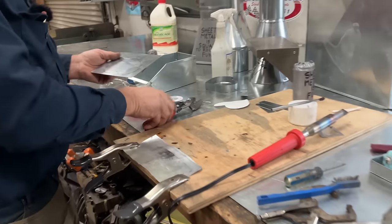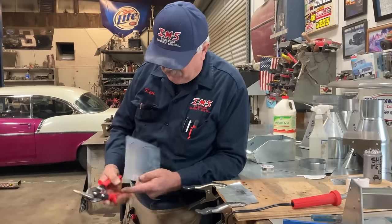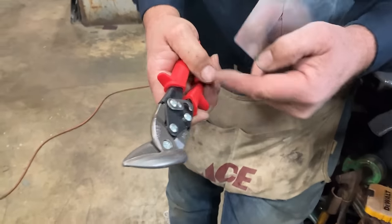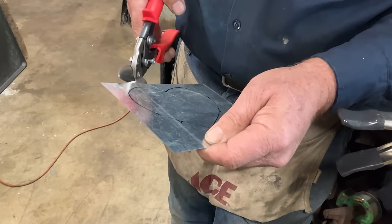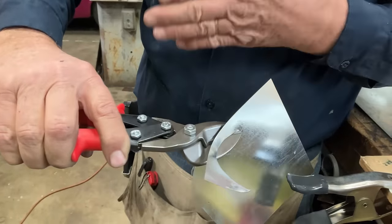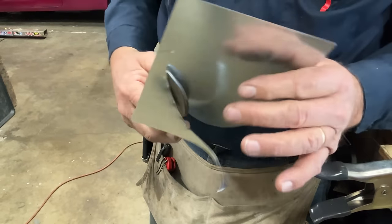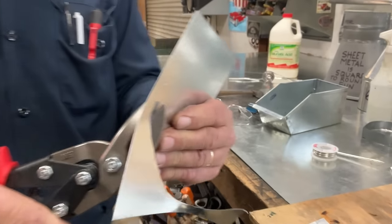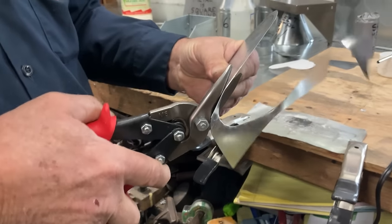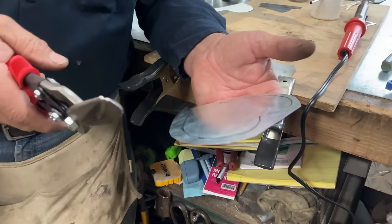Smarty pants. So now let's cut that out. But we talked earlier about the 85-15 rule, and that is whenever you're shearing, when you're operating a pair of snips or even a shear, around 85% of the energy that you add to the snips goes into performing the cutting motion. 15% goes toward moving and separating the pieces to allow the shears to move forward. So right now I'm doing two things. I'm cutting and I'm also spreading. If you look, maybe if you watch from right there, can you see the spreading? So I'm doing two things. I'm shearing and spreading. Roughly 85% shearing, 15% spreading. So now we cut off a lot of the excess.